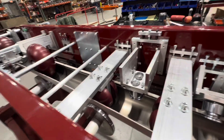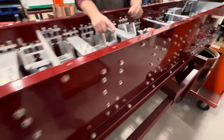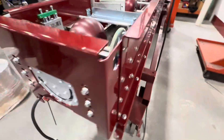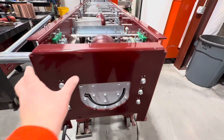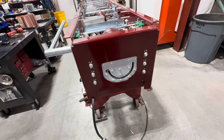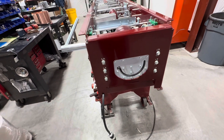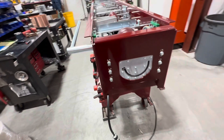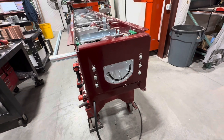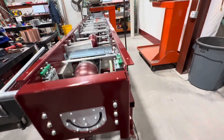If you hit a big bump, you don't want the rollers to bang off each other — it'll knock itself out of adjustment. There is a sticker on the back of the machine and it's also in the manual: never transport the machine empty. We probably need more stickers, because employees don't always read them. There's a sticker on the top of the back that says 'Do not transport machine empty.'